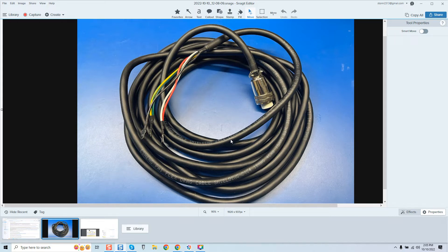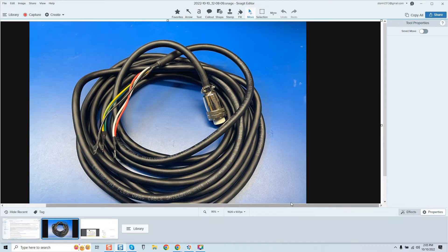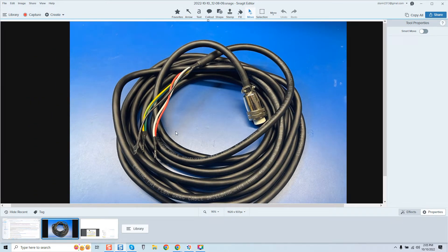Let's look at some details. We've got an 18-gauge, 80-degrees Celsius, 300-volt cable. It appears to be a flex drag cable by Yisheng Pai. Looking closely, the part number is SP483. Without a doubt this cable is a knockoff of mine — the reason I call it a knockoff is because he's trying to mimic what I do on my cables by attaching a shield drain lead going to the ground lead, which is probably the best thing he did.